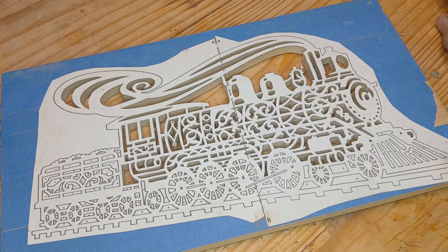Most of these are 3s, but I might even go to 1 in a lot of them. Up here I could still go 5 in some of these, and definitely could go 5 or even larger here if I wanted to. But I cut 80% of my cuts with a number 5 blade — that's just my go-to blade. I'll cut the outline of this with a 5 probably; it's just the best cutting blade for me with the widest range of use. The other 20% is done mostly with 3s and 7s. I have every number there is — I even have 12s and spiral blades. A spiral blade is another animal; if you're not used to it, you've got to practice. But there are some cuts I've made that I couldn't have made without a spiral blade — I can cover that in another video.